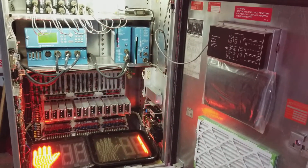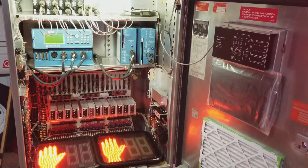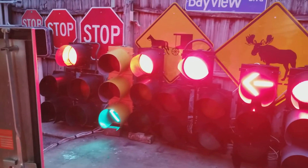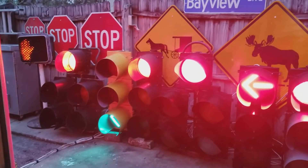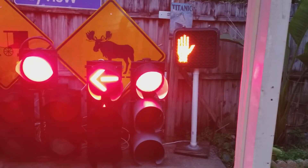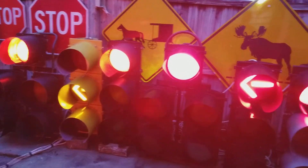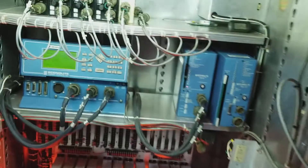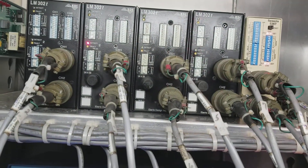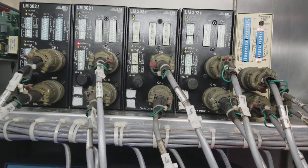It's been a busy day — I got everything all rewired, got a couple more loop detector units in, and got the whole entire system up and running. You can see the pad down there; everybody's working, got a green arrow going, yellow works. There are my loop detectors right there. The three on the end that are just flashing have no loops connected to them, so they're erroring out.